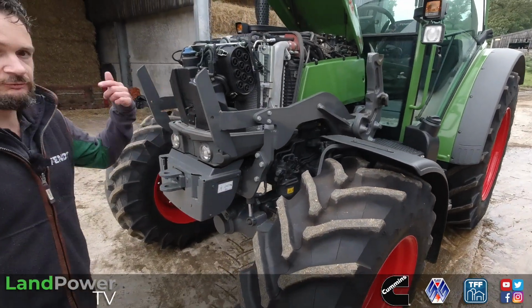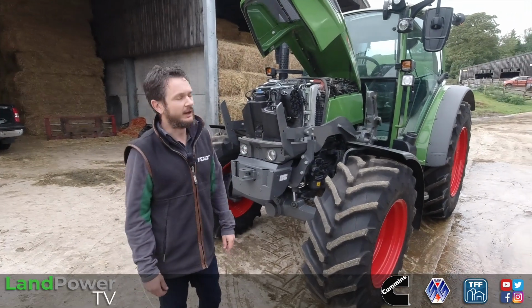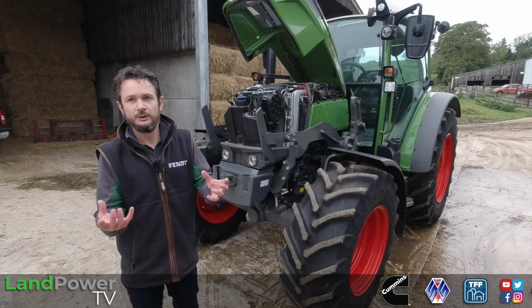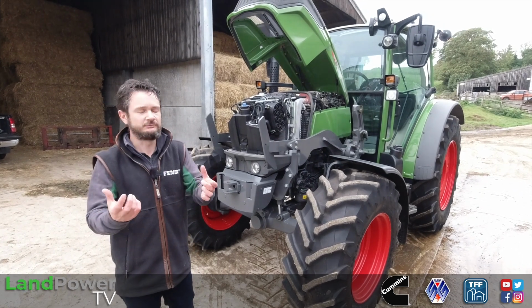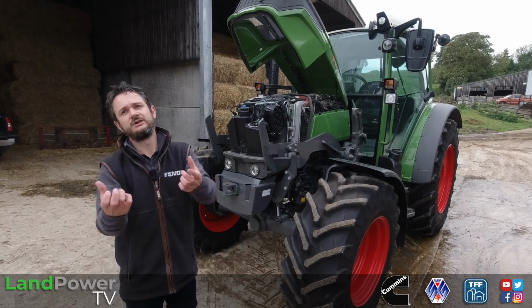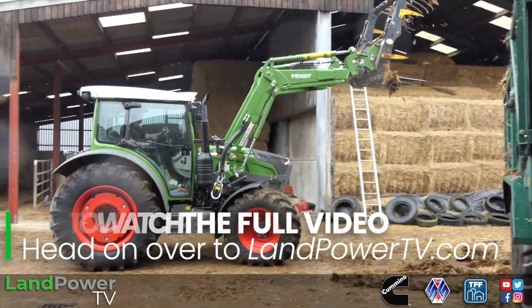We can also, if we want to, have a reversible fan in there, where the fan speed will effectively be fixed, but they'll change the pitch of the fan blades. Okay. And then obviously if the criteria is met for the timer and engine load and all that lot, it would reverse the pitch of the blades to give you that reversing. Got you. With those ones.